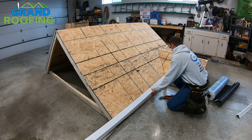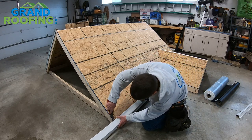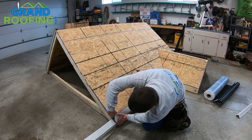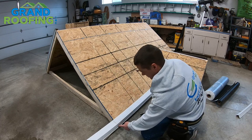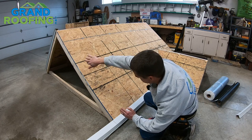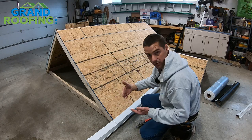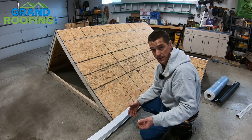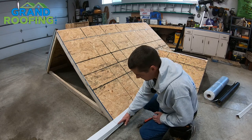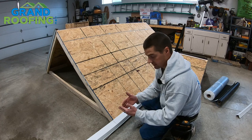Once you get that kind of set where it's going to be, mark your face out here and cut it. You can also hang your face over just a little bit and fold it over — the concept of that gable coming down, it will overlap a little bit. It just makes it cleaner. It's not necessary — some people think it traps water, some people don't. I've probably run into more trouble folding this over when you've got a gutter hanging out too far because it's going to hit the gutter, so you can't do it in that case.